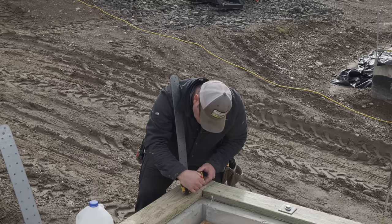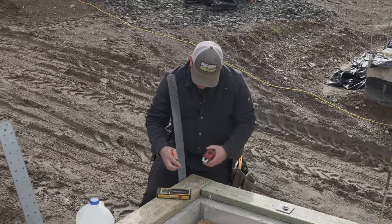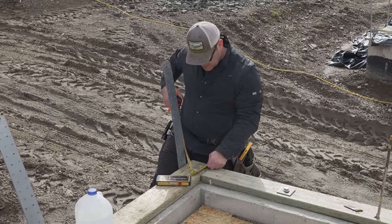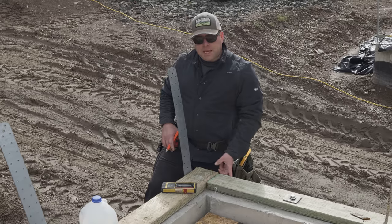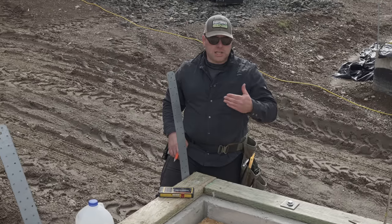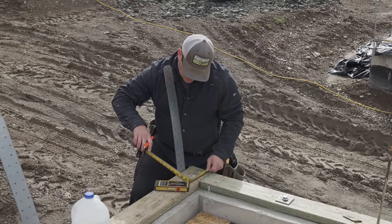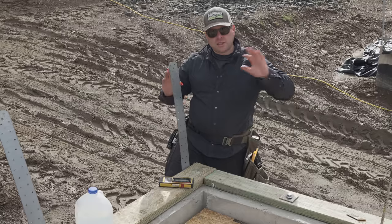Okay. So I'm gonna line it up with the thing there. So what I have here is off of this, I have 3/8. But remember, we were always going 5 3/8 down in the basement. I have 5 1/4. That means that we're within an eighth if I measure from the outside, which is what we did downstairs. So if I was really concerned, we could adjust. I'm not concerned. 5 7/16. Now we are 5 1/4. So we're gonna call that good. We are as square as we need to be.